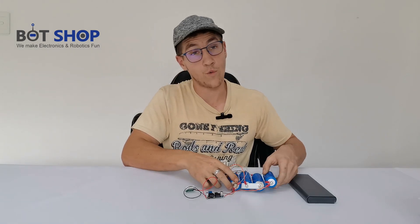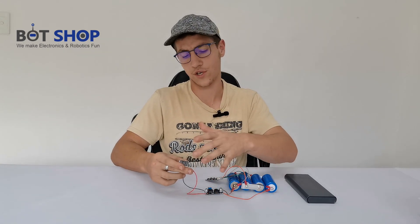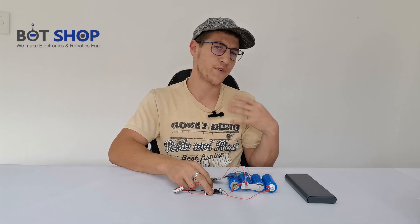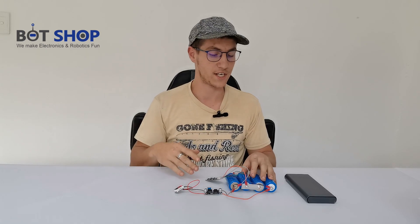Now, what do you do if your router is running at 12 volts but you're getting 13 volts out? That's why I have included this little buck boost module, and I've also added a volt meter to make it easier to show you what's going on. The buck boost module can take the input voltage of any DC source in a certain range and output exactly what you need — so if you have a 5 volt source it can put out 15 volts, or 2.5 volts, depending on your application.